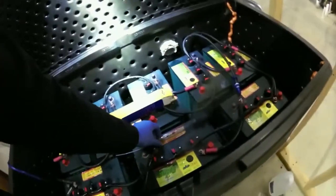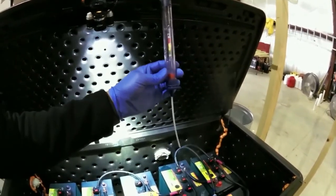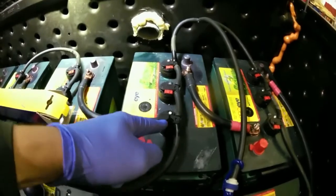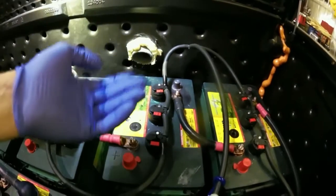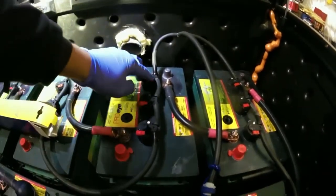This is my hydrometer — the one I provide with almost all the systems I do that have a battery watering kit. The great thing about this battery watering kit is you connect this tank up to it and you can water your batteries almost instantaneously. These little white float valves will pop up when the battery's full and keep it from putting any more water into the cell.